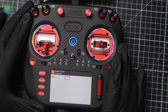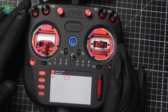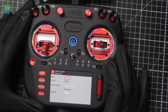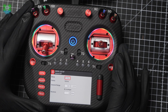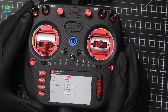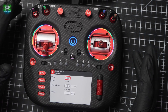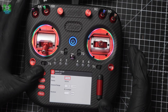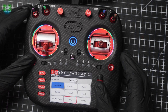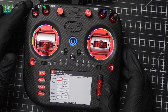It's going to ask whether we want the internal RF on or off. If we leave the internal RF off, our ELRS isn't going to work, so we need to turn it on. We're going to select CRSF — that's the protocol for Crossfire. We have an option to instantly bind our quad here, but I'm going to show you the more unified way that everybody uses so it makes more sense later on. External RF should be set to off, which it is. Leave trainer and timers for now.